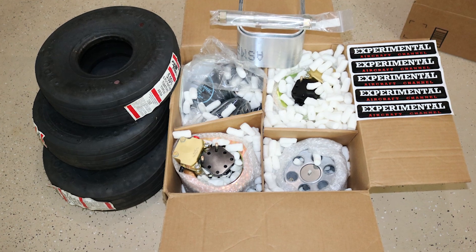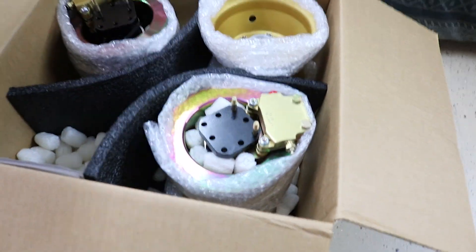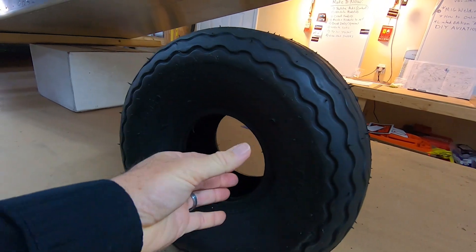A few changes since I decided to build this thing - this is the Cruiser, not the STOL version of the Zenith CH 750 Cruiser. It came with baby tires, five by five, and I discussed with Zenith that I might be visiting more people off-airport than on-airport. I had a concern about maybe catching a gopher hole or something like that. So ultimately I decided to swap out my wheel, tire, and brake package. When you go from a five-inch to a six-inch, your wheels, brakes, and all that has to change. So I went to a six-inch wheel and more of the STOL configuration on the nose fork, which is also different. The nose tire is the factory-size CH 750 STOL size tire, and on the mains I was going to go to the factory-size STOL tire as well, but they've got an option now to go up one size bigger.